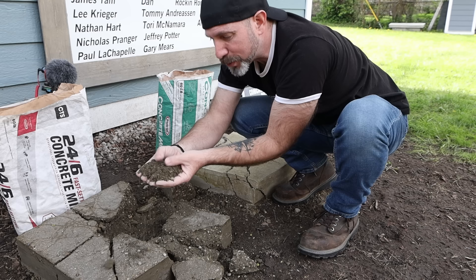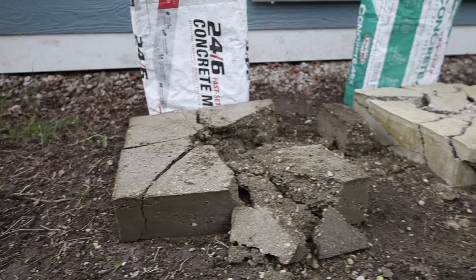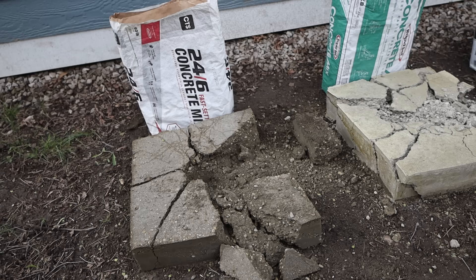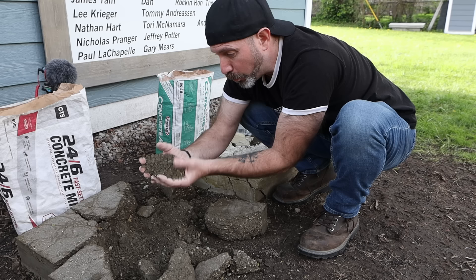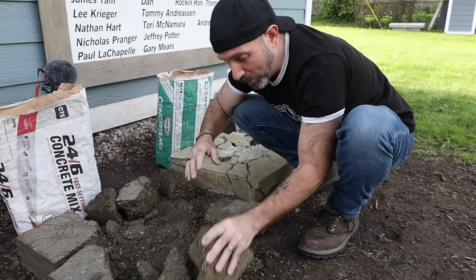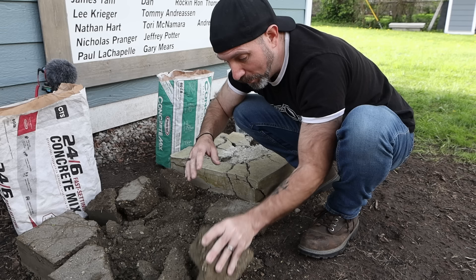I really feel that since we've got so much moisture in this mix, this is going to harden. I don't know that I could say one performed better than the other, but I will say that the RapidSet 24-6 had the most solid chunks with very little loose material in the center, and this one took me three good swings instead of one to two swings with the rest of them. But I want to cover RapidSet's butt — RapidSet had nothing to do with this ridiculous test. I will see you in two weeks when we crack open that original slab.